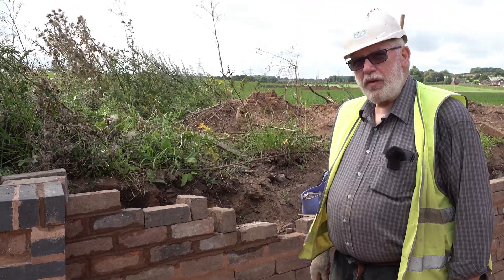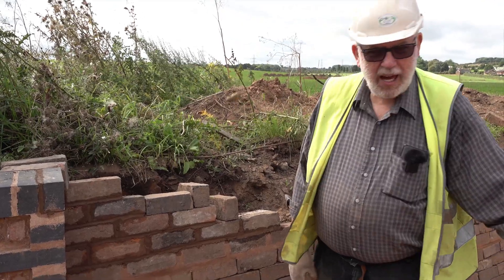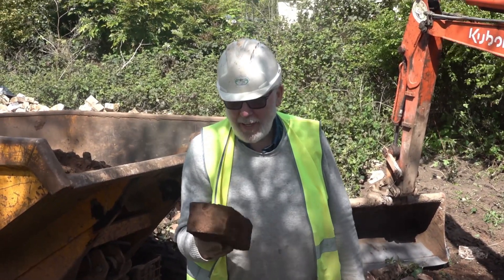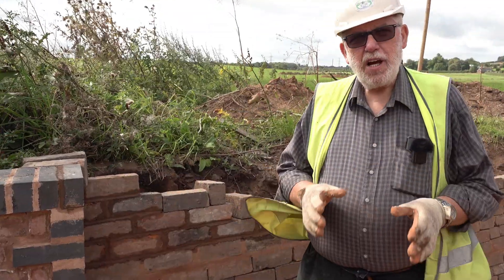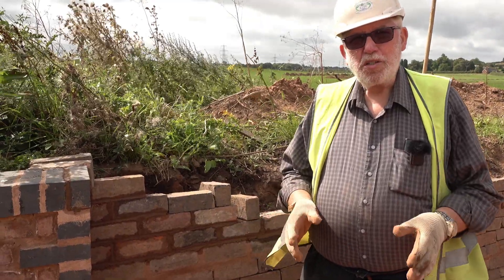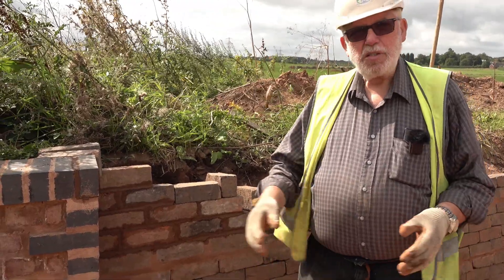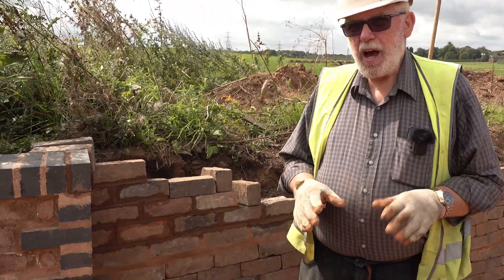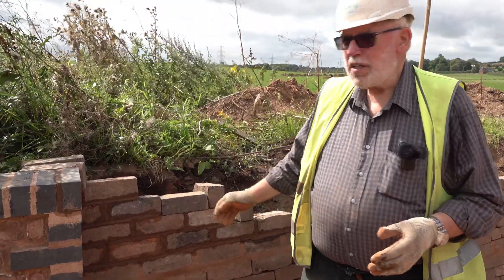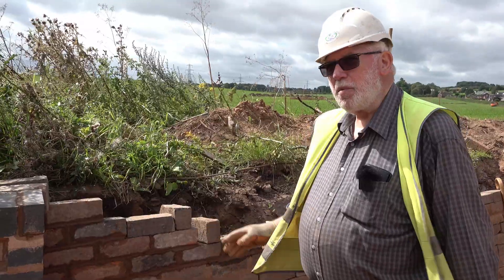It's consistent with what we've had at lock 18. You've been here filming before when I've been digging out bricks down here, saying 'odd bounty, the earth gives up its bounty.' These were bricks laid when the canal was constructed and they did not use a bonding agent — no lime cement, no cement at all — just bricks on top of bricks. That's why it was so easy for us digging them out; we didn't have to clean them before using them.